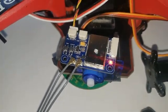Now all you have to do is lower the throttle — you'll hear a beep — and that's it. Your ESCs are all calibrated. When you gently push up on the throttle, you should see all the motors spin. That is the all-at-once ESC calibration method. It's extremely important to calibrate your ESCs or the drone is going to fly wobbly, so make sure to do this step.